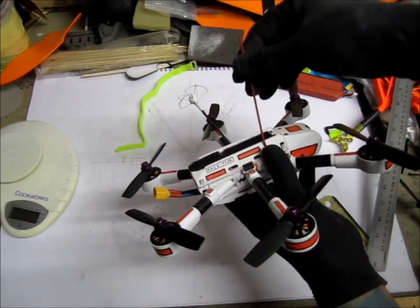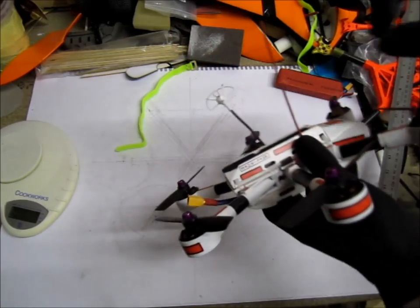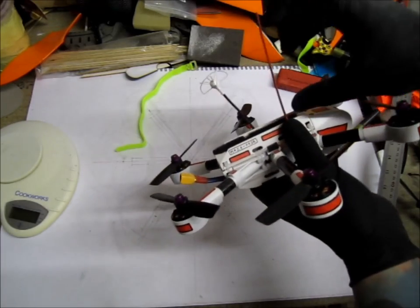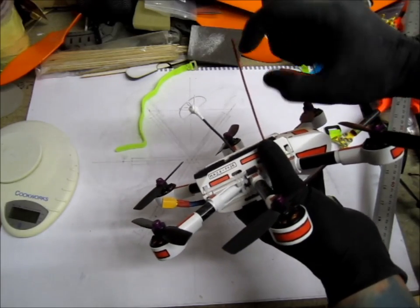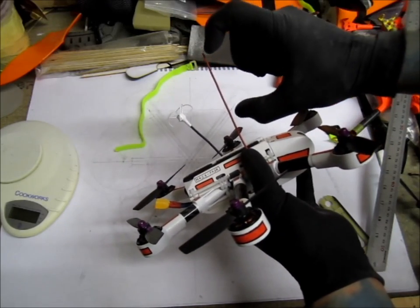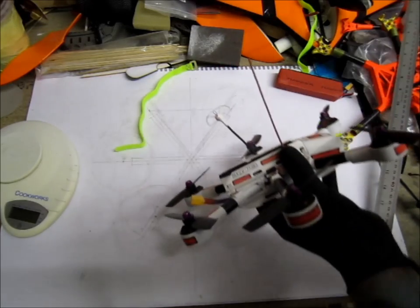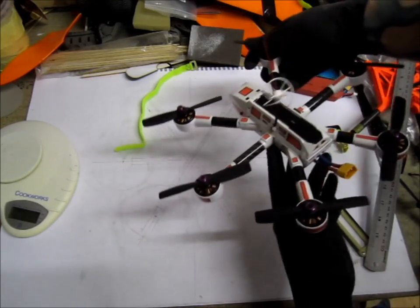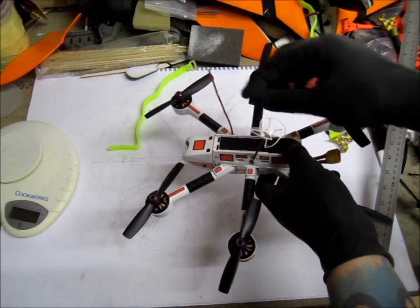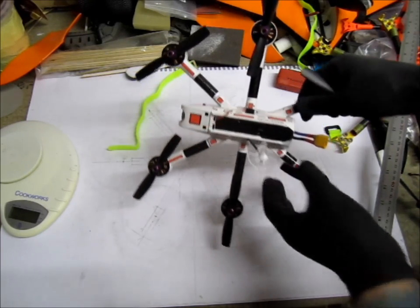TBS Crossfire RX — I threw out the existing antenna from the Micro RX. A quarter wave is 82.2 millimeters for 868 MHz, I think, for Europe. So I took a Frsky antenna, got my connector in, and chopped it down to 41 millimeters, without the coax cable. That gives me a 1/8-wave antenna. I tested it on 25 milliwatts with dynamic power off — I could go half a kilometer with the 1/8-wave without any failsafe, without any glitches. I did the ground testing and it was all good. Brilliant.